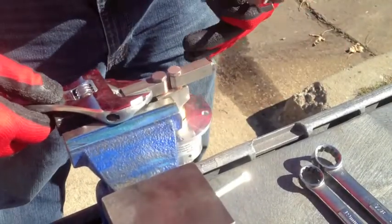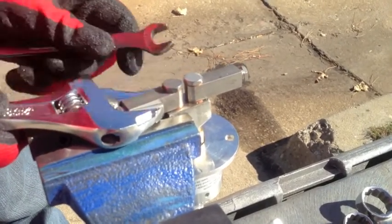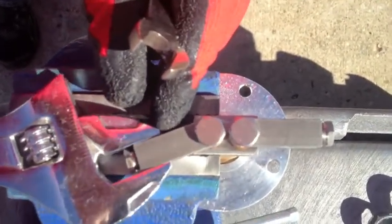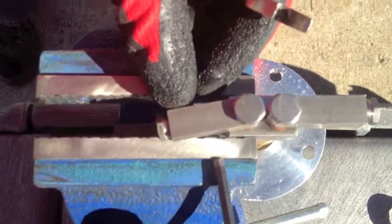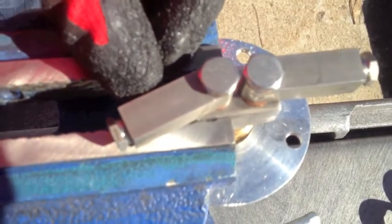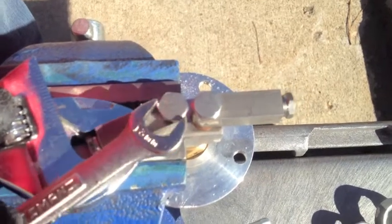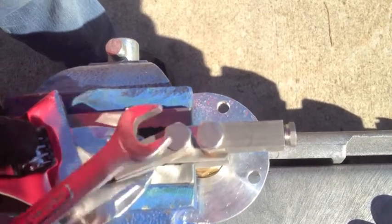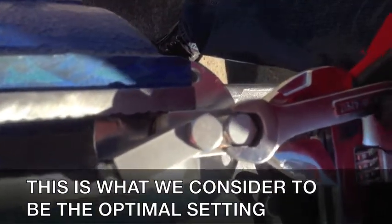We've put our head back in the vise to make it easy. We're just going to knock this piece a little bit loose. Now what we know is if you look straight down on top of this, the edge of that wash arm — really is about on the edge or the point of this block. That's about where we're finding the setting really needs to be at, and that gets us a decently slow RPM. I'm going to hold that head in place and come down trying to hold it right off the corner, cinch it down good.